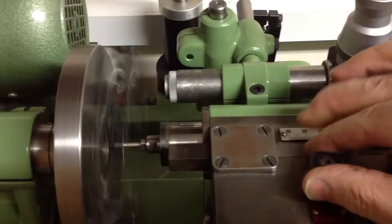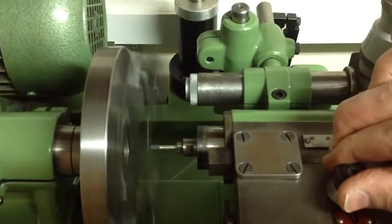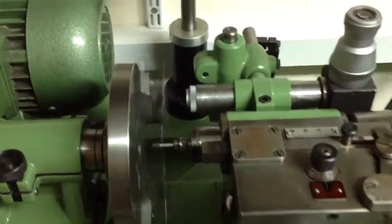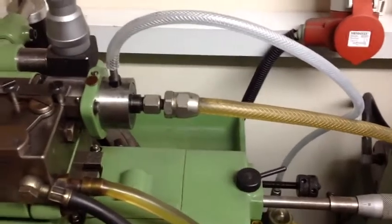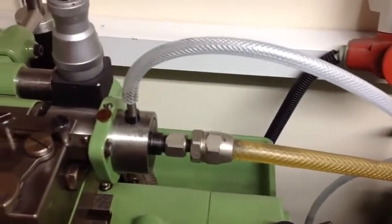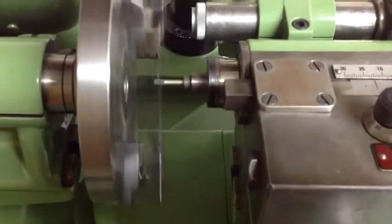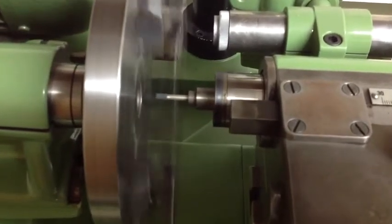As with the other unit, the speed can be changed quite significantly with the knob on top — it can go really very slowly or at a speed that's pretty fast. In terms of driving the main spindle, the first thing again is to turn on the oil mist lubrication coming in on the top tube. Turning that on also starts the spindle, which you can hear whining. I'll turn it off and on again so you can see the spindle start up.